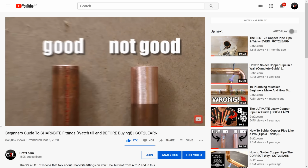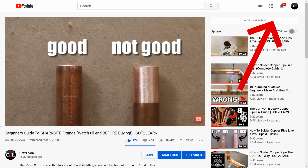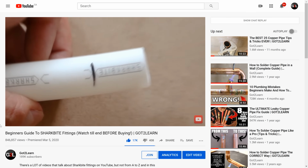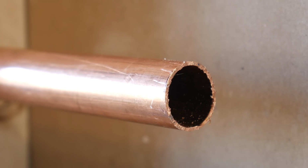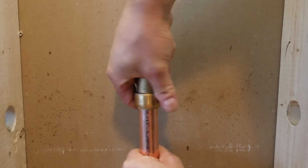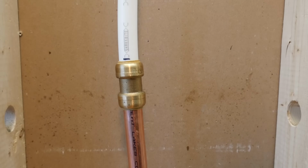If it's your first time, I suggest you pause this video and watch this one right here. This guide has everything you need to know on how to install them, where to install them, and a lot of other important things. What's nice is that these fittings are also good for the other transitions in this video, so it's really worth watching. You basically cut the pipe, make sure there's no sharp edges, mark the insertion depth, and insert it. What's nice is that they work on different types of pipes, so there's no special transition fittings needed.